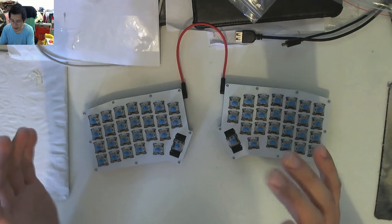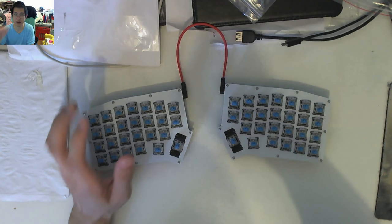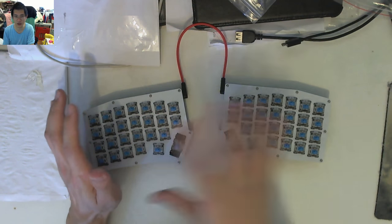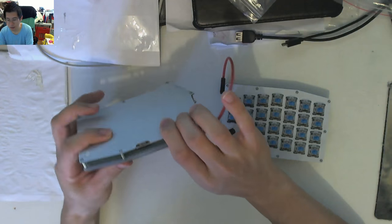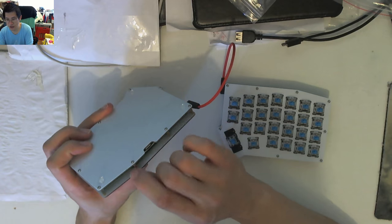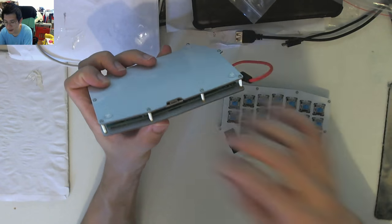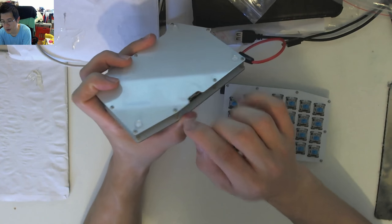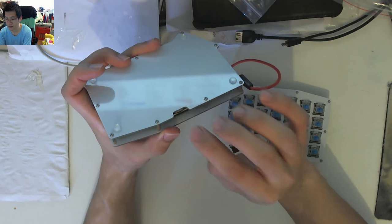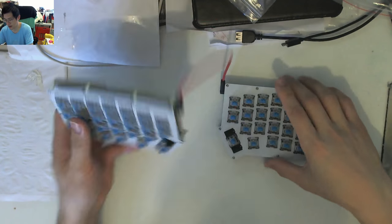And you might say, well, I haven't flashed them yet, I haven't tested my Pro Micros yet. Yes, that's correct, that's true. That kind of stuff typically for me takes a little bit longer to get my head around, especially for split keyboards. And the beauty about what they've done here, what JPConstantineau has done, is the reset switch is very easily accessible. So it's right there, and I can just get in there with any object that's long and firm enough, like a bamboo skewer or whatever. I can put it there, screwdriver, and just press, and it will reset, which will allow me to flash. So I have absolute confidence that that will not be an issue to manage later on.